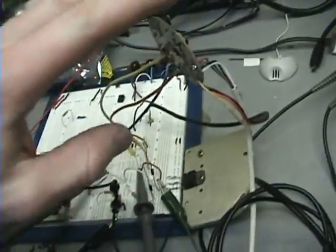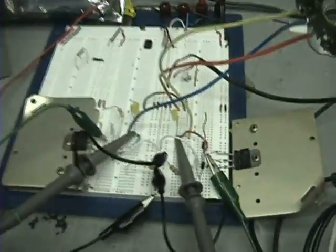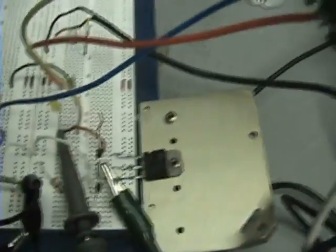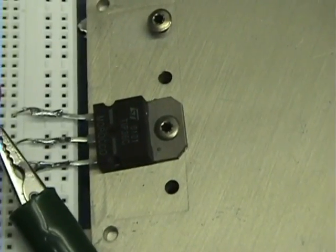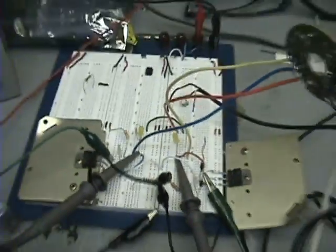This fan motor runs off a hall sensor right here. Instead of powering it directly from this board to my motor, I've externally pulled off the outputs and basically turned on a transistor. These are TIP36C transistors. The LEDs are just for looks so I can see what's going on.